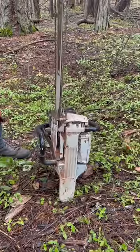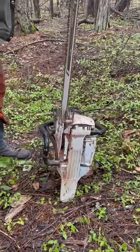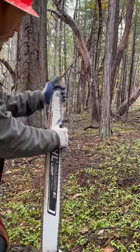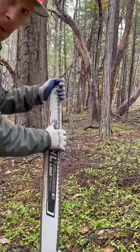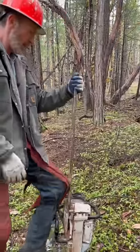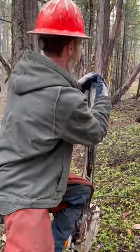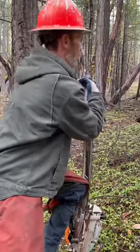Make sure your chain is on the sprocket. Start putting your chain into the top rail of the bar. Push it over the tip until it won't go anymore. Take your knee, bend the bar as you work the chain over the tip.